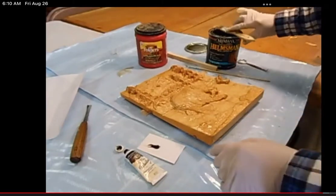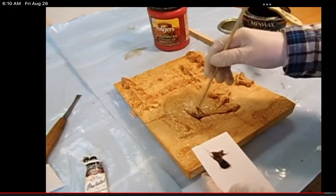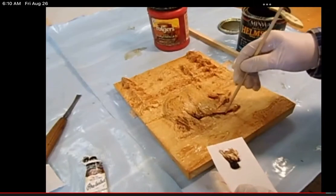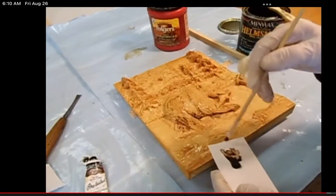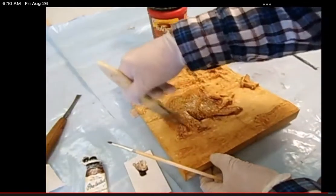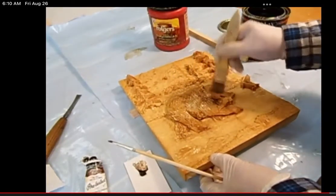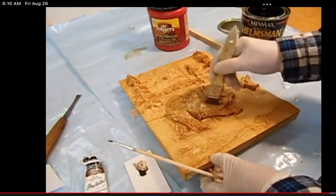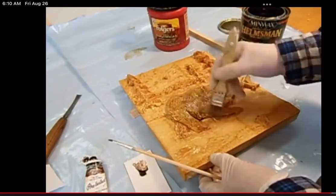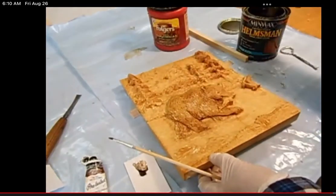Now that's all clear varnish. What I'm going to do is start building my shadows — I take the burnt umber and just start building the shadows, then blend them all in with the bigger brush with the varnish on it. Oil paints and polyurethane varnish mix very well. If I had a little bit too much paint I can move that paint around by just using the varnish.